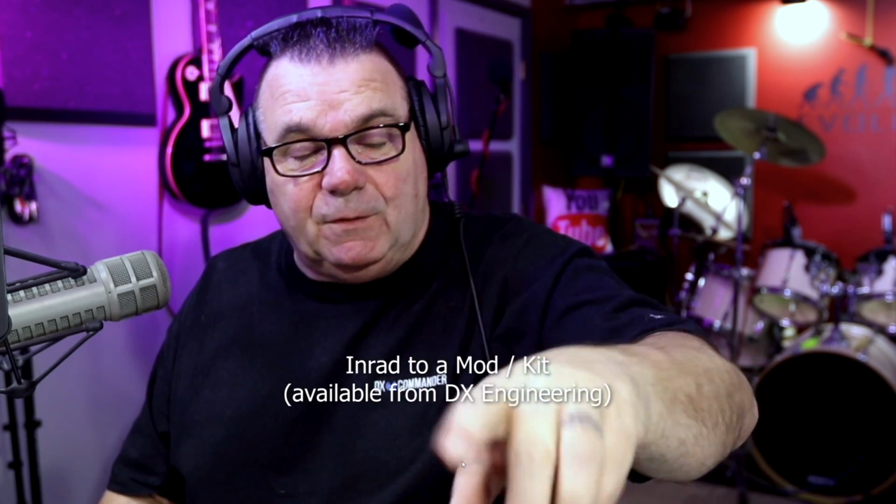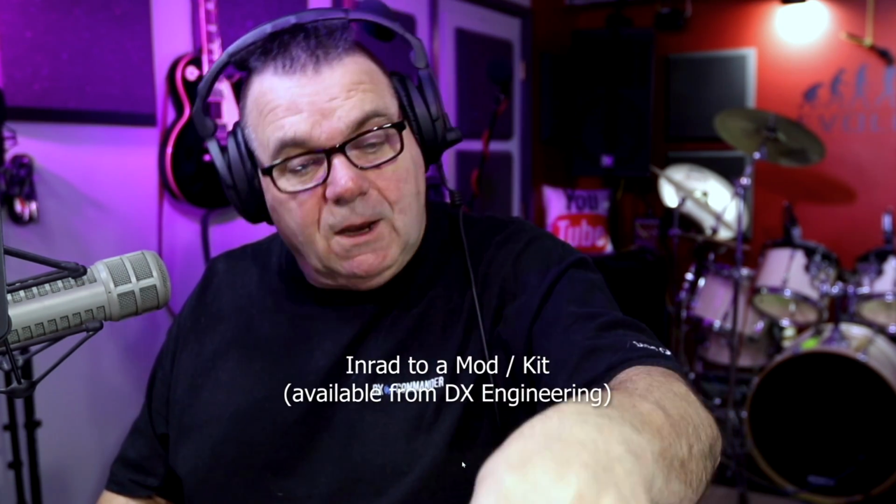If you haven't got a 2 VFO radio, and even a 7300 has this on the main board, it just doesn't have it brought out. I don't know why they didn't put a socket on the back. But the ICOM 7300 is the one radio I know at just over $1,000 that doesn't have a dedicated receive jack. If you've got a 7300, you can do a mod and bring a jack out that's on the board to a little phono plug or something on the back. So you're now dedicated on receive.